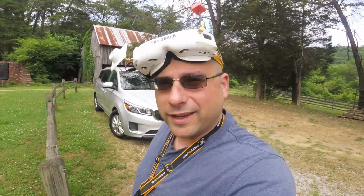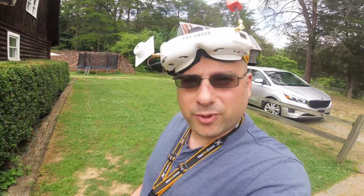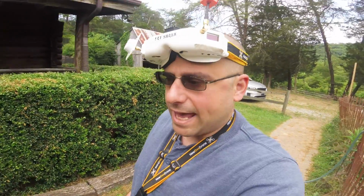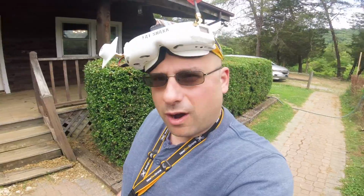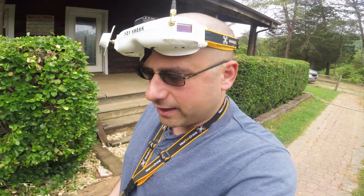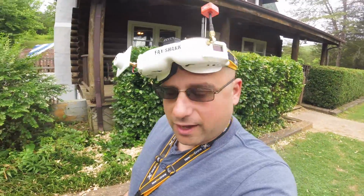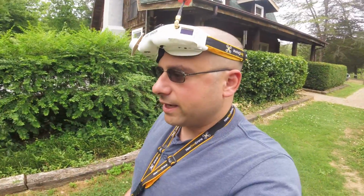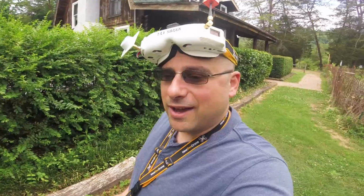Honestly, that is going to be really tough to call. The difference is, I think, pretty subtle. I don't think I could have picked out anything bad about either tune, like in terms of nose wandering or anything. I think there was more prop wash oscillation on the second one because of the higher P gains without raising D gains. So the next step might be to raise D and try and clean that up. But to be honest with you, I'm not sure I would have complained about the first one, the stock defaults.